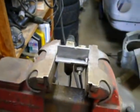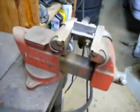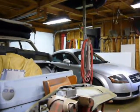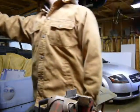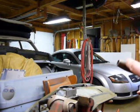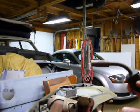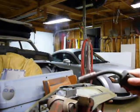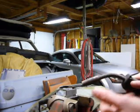I've got a little setup here. I'm going to make a couple welds and compare the two and show you how dirty the flux core is compared to the MIG welding. There's a big difference between the two. One of the big differences is that the flux core welder is always live — the trigger here only controls feed and not power to the gun. So if I touch it, it's always on. With the Lincoln, you can touch it right to the work, flip your mask down if you don't have an auto-darkening shade, pull the trigger, and then start welding. With this one, you have to kind of guess where you're going.